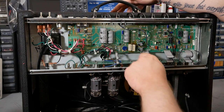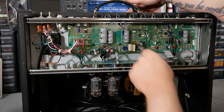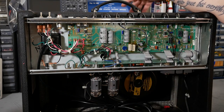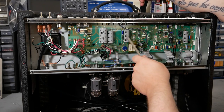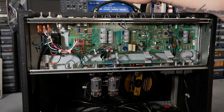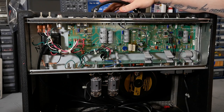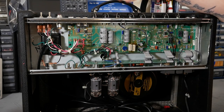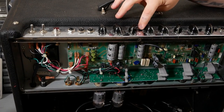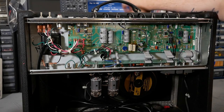This amp has already been modified a little bit. The screen resistors here have given some heat to the PCB and discolored it. The person who did the repair did a good thing, which is elevating the screen resistors off the board. A couple of caps here have been replaced — these Illinois capacitor caps are notorious for leaking and going bad really quickly. Again, problems we're not going to have to deal with because we're swapping all of this out. We're interested in the iron, the tubes — all these tubes should be good — the chassis, the knobs, and hopefully the face plate, which will have to be re-drilled. The square buttons on top will need to be drilled out for round toggle switches. It's pretty simple, even compared to some of the pedals we look at.